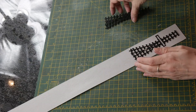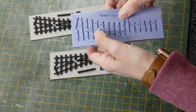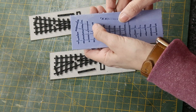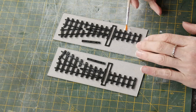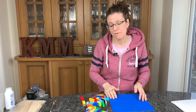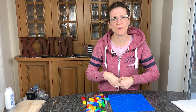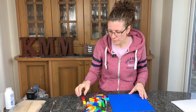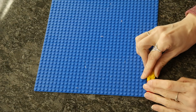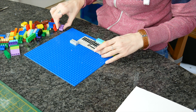The first thing I need to do is put the rubber on them to make the mold, so I'm going to mount them on this bit of card. I don't want a huge amount around the outside — these are quite thin castings and rubber is expensive. On this mold I did first, it came under the glued-on point, so I sealed it with a bit of white glue around the edge to avoid that. The mold itself is obviously rubber, but the mold needs to be contained in something or the rubber will just flood everywhere. For that I use Lego. You can use foam core and hot glue, but I find the edges get a bit messy. So I'm going to start building walls — the key thing is to remember to stagger them.